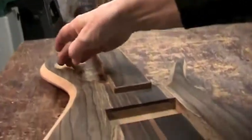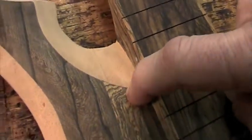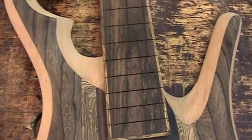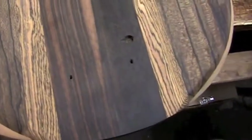But up here, when we did the line here, this piece here came all the way out. And you can see we tried to fix it. Pete went in there with a chisel and pulled it out and carved it a little bit. And the same thing over here. And what happens is the line gets broken, and we could be here all day playing around with this thing. And maybe we might be able to pull it off, you know. It was really my fault for not letting Joe know that you got to keep the same depth. When they asked him to inlay those pieces, he just inlaid them. And he did a nice job. Everything's nice and clean. No problem. It's just the difference in the depth causes a little problem.